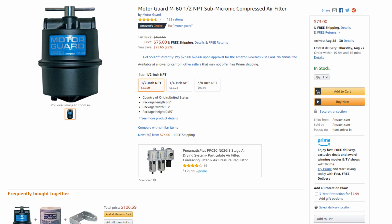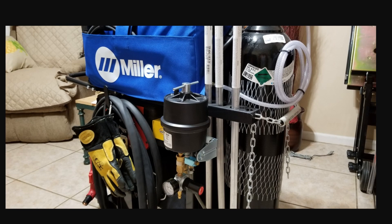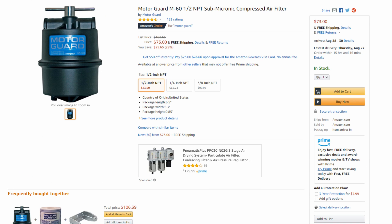So guys, I think it's really worth it to add filtered air to your system. If you have a welding cart or plasma cutter cart that you can attach it to, that is 100% your best option — it will really prolong the life of the filter and keep costs down by only running the air through it that's going directly into your machine. If you're running expensive consumables, this will save you a lot of money in the long run and give you better cut results for longer. If you have any questions about these filters, leave them in the comments below. I'll have links to all the filters in the video description. Thanks for watching!